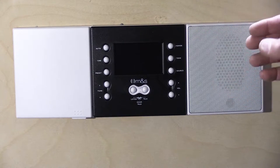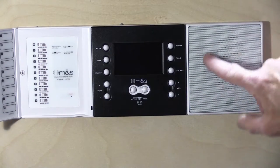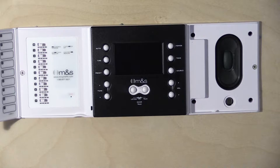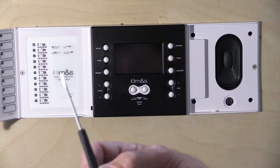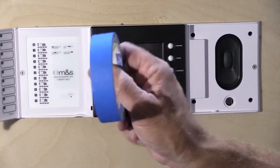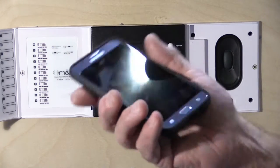You must turn the circuit breaker off. To remove the master station, there are two panels at either end. The left panel is a door with room control switches behind it and one faceplate mounting screw in the center. The right is the speaker panel, which pops off. You'll need a few tools: a standard Phillips screwdriver, a small flat screwdriver — 2.5mm is the perfect size — a Sharpie, blue masking tape, a pencil (yellow is my favorite), and your phone.